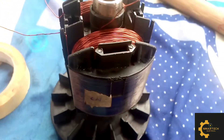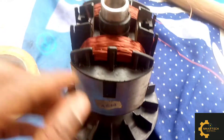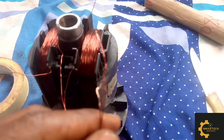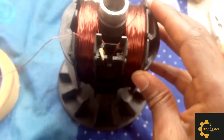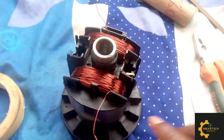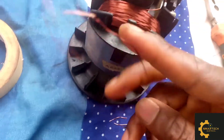Now we're going to make our connections. Always refer back to the diagram. It is a start-end connection: start and end bridged together, start to the positive of the diode, end to the negative of the diode. You can pick any start and end pair to bridge, then connect the other start to the positive of your diode and the end to the negative. You can see the start and end looped and inserted at the side of the armature — the other start and end are the ones that go to our diode. Start to positive, end to negative.